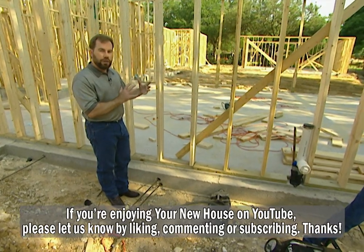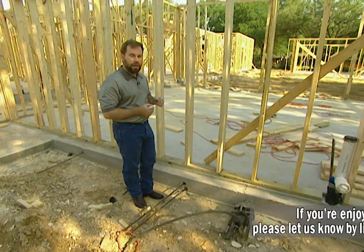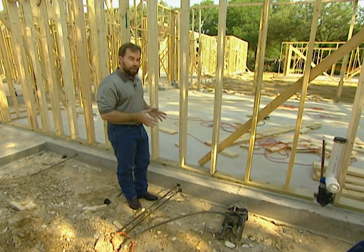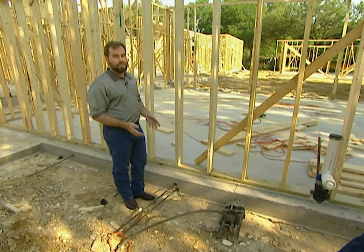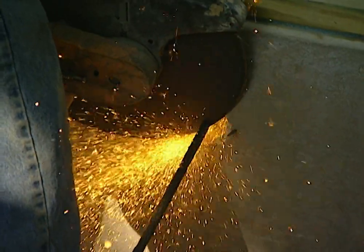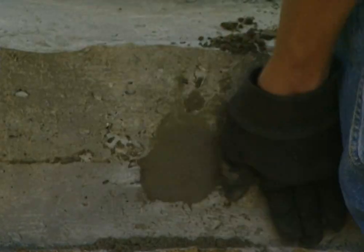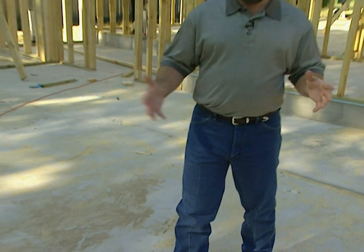The foundation should stay in one complete piece — meaning walls will look good, and we won't have a lot of drywall cracks. Then Sean comes in with a saw, cuts all the cable ends off, and mortars over them so it looks just like the rest of the foundation. With 128 piers over 20 feet deep, plus a mat foundation, and post-tension cables pulling it all together, we should have a solid foundation that will last many generations to come.